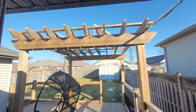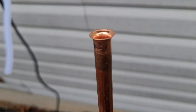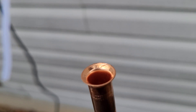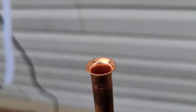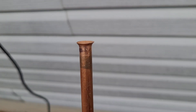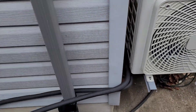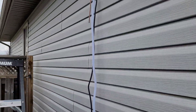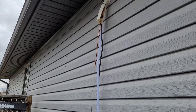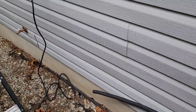That's where the solar panels are going to go. I have two of them up there right now, and I'm going to be adding four more. If you're ever installing one of these DIY kits, it's always a good idea to check out the flares before you install them. This one had a pretty good burr right on the seat of the flare, so I've cleaned that up a little bit — it doesn't look too bad now, but it's always worth checking. The line set is also 15 feet, which is not going to be long enough for the spot I want to mount it. So I've cut the line set in the middle and I'm going to be adding some copper so I can use the flares and make it go where I want to.